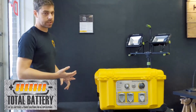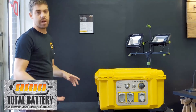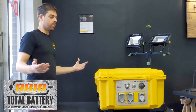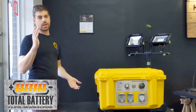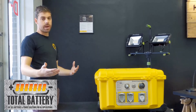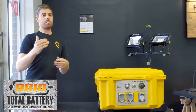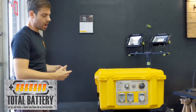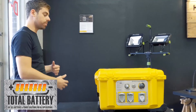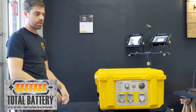These batteries are completely sealed lithium batteries, so you do not need to worry about any hydrogen venting or replacement cells. They're good for about 3000 cycles — one cycle is one charge and one discharge. After 3000 cycles you'll have about 80% of your original energy remaining, meaning the pack isn't completely unusable, just with less run time. People tend to continue using them down to 50, 60, or 70 percent depending on the application.